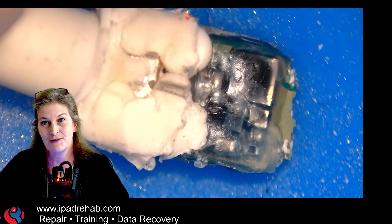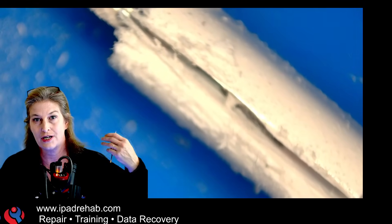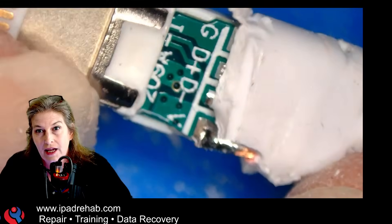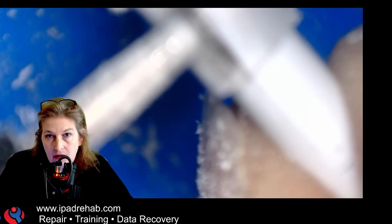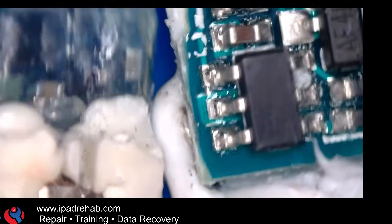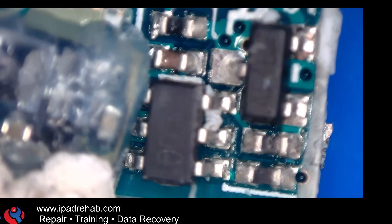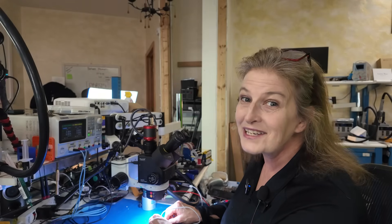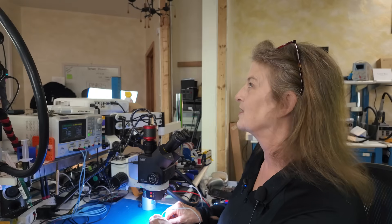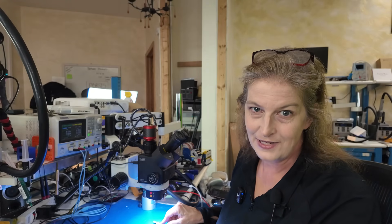Now what does Nick's cable look like inside? I don't think there's that same metal surround. Peeling off the plastic, we notice it doesn't have any of the waterproofing epoxy that completely covers the Apple cable. There are two very different boards. We can see a completely different set of chips — I can't find a data sheet for these, but one I found was marked 'obsolete, don't use anymore.' These cheap cables — the ones Nick used — are phone-killing cables, especially combined with the variable voltage from an airplane seatback USB port.